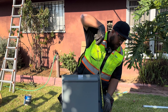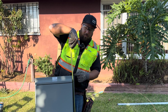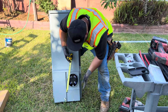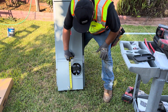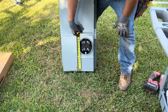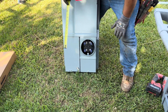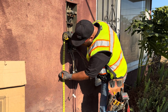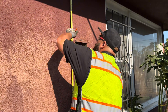Next, we measure the opening for our panel — 14 and a half inches wide by about 43 inches tall. We really want to measure the flange, which is 44 inches. I usually break out an extra 6 inches so we can get the wires into the top of the panel. The utility in our area doesn't allow the meter to be below 48 inches, so we measure up to center of the meter — it's 10 inches — meaning the bottom of the panel can't be below 38 inches. We typically set it at 39 to 40 inches.